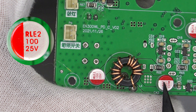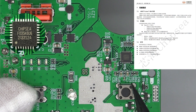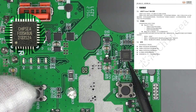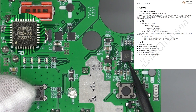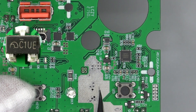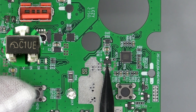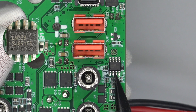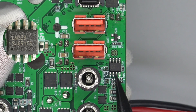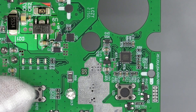The IP6538 also supports dual USB-C ports or a USB-C and USB-A port combination. Those two solid capacitors are used for the input and output filtering of the USB-A port, 100μF 25V each, with a toroidal core inductor between them. This MCU from Chipsy controls the power station and integrates a 32-bit M0 core, 32KB flash memory, 12-bit ADC, and 4KB SRAM. The voltage regulator chip for the MCU is also from Micron. There are four battery indicator lights here. The operational amplifier detects the output current of the DC port for overcurrent protection, marked LM358. The buck LED driver is also from Micron and integrates a MOSFET.